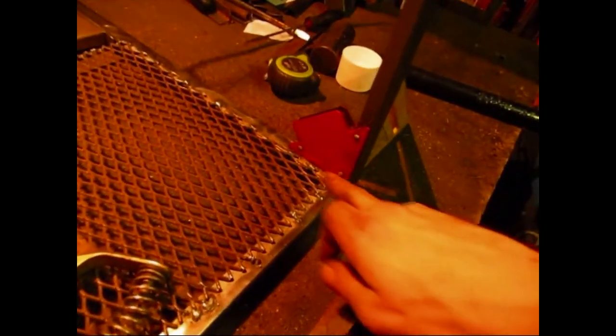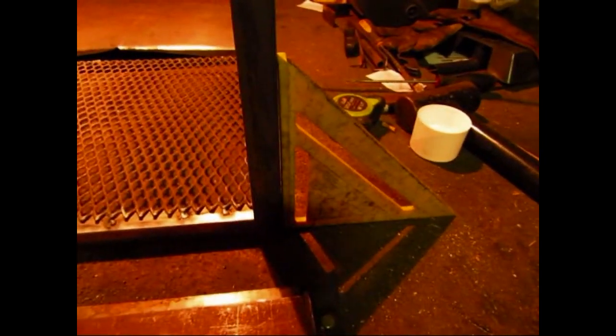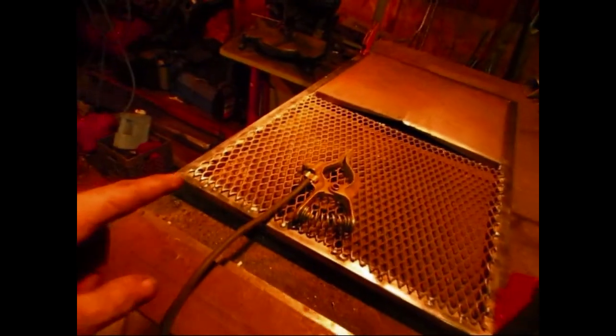What I'm going to be doing now is putting on the legs. This is how I've got it set up — I've got one of these little angle magnets holding it up and then I have a little plastic square right there. I'm going to weld and then do the same thing over there on each one, then put it over on its side and put that piece on.